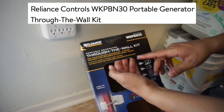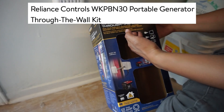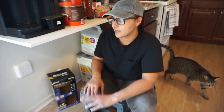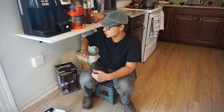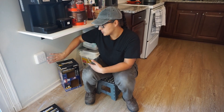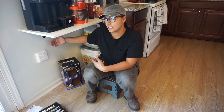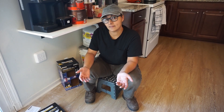I've already installed it but I will show you footage of some of what I did. The point of this thing is so that you can run your generator outdoors away from your home, run the 10-gauge wire to the panel, and then have all your doors closed and run extension cords from your refrigerator to this panel — to eliminate the hazard of poisoning yourself and your family inside your home.